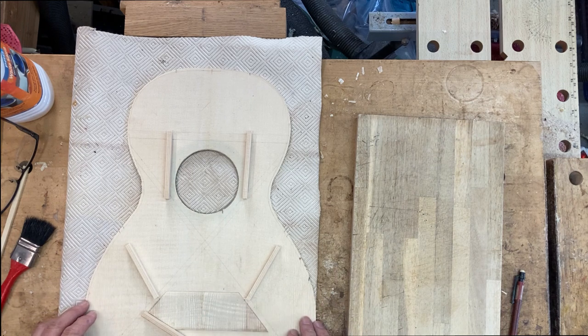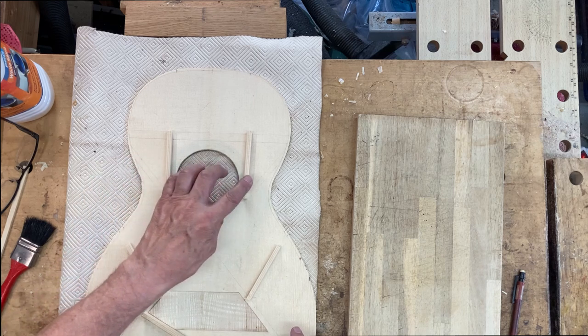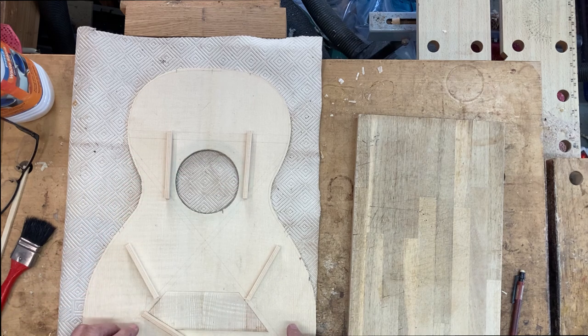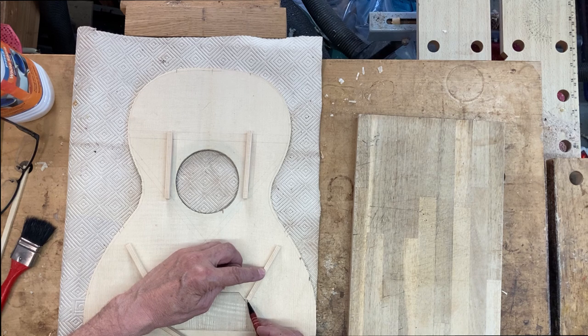Can see the underside of the top, and I've already glued the bridge plate in place, which was cut from some offcuts from the back, and the next job is to glue these small braces down. They go before the X brace because they're interlocked with the X brace, so the first thing I need to do is to create a small projection like a tenon here at the bottom, which will engage with a mortise in the X brace,